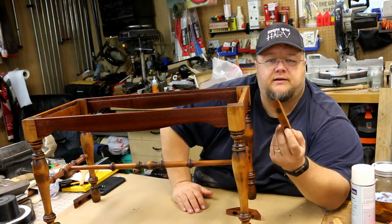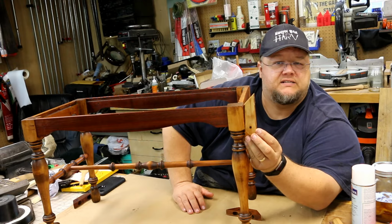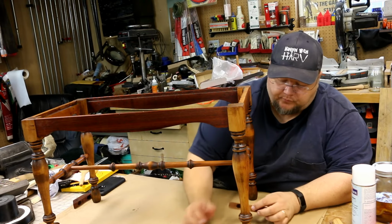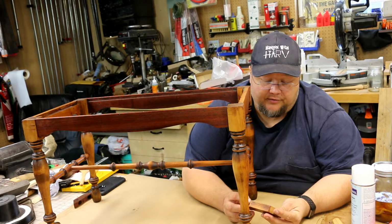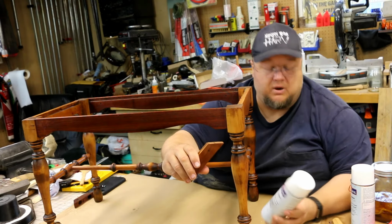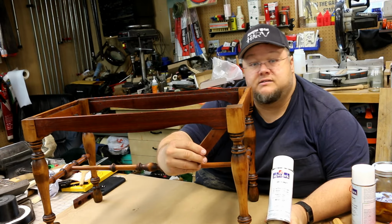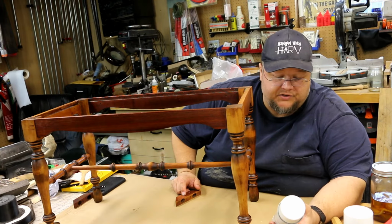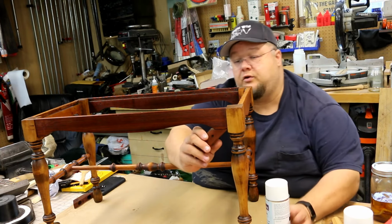And then basically I came back here and I took one of the corner blocks that I believe is pretty much this same species of wood here. And obviously it's a corner block. It goes inside. It's for attaching the bench seat. So I took these that I had already, again, applied that finish to, and I used 2 different toners that I purchased. The first toner that I tried is this brown mahogany from Mohawk. And as you can see, if I hold this up here, it's not bad. However, I also purchased another one that's dark red mahogany. And I actually like that so much better.